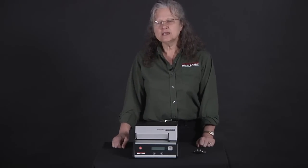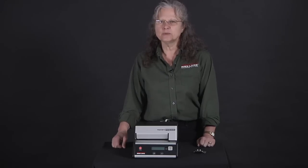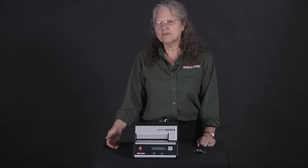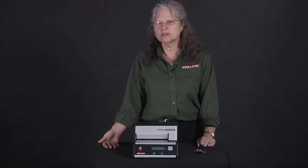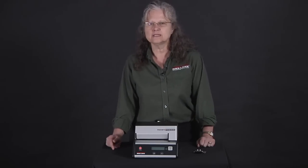Enable ticket sensor is either on or off, and when it's on, a red light will appear on the display and insert ticket is displayed on the display itself. If it's off, the printer won't know you don't have a ticket installed, so it's not going to buffer the data. It's going to attempt to print with no paper in the ticket space.